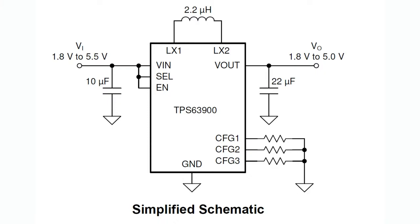Here's a simplified schematic. One thing you'll notice is it's synchronous — the transistors are all internal, so you don't need an external transistor or an external Schottky diode. It's really easy to use. You've got an input capacitor, output capacitor, and then the inductor. One thing that's neat is that this is a Buck Boost Converter — only one inductor needed — and it's about the same price as a Buck or Boost Converter, but you get both peanut butter and jelly together in one.